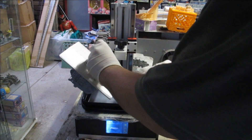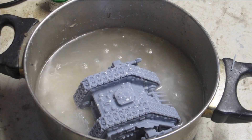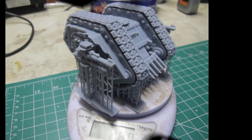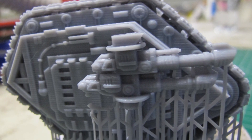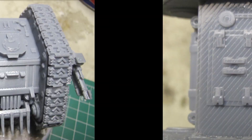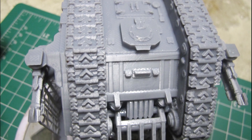With no struggles, failures, or issues, we have a complete print. It was promptly removed and cleaned in isopropyl alcohol, then allowed to naturally cure under sunlight for a couple of hours. Both resin and cleaning alcohol are reclaimed. The model came out very crisp with sharp details, soft walls, and the Z-axis lines are not overly noticeable — nothing a coat of primer or paint won't fix. Larger models risk splitting or falling off supports, but it came out completely perfect as per the slicing software.